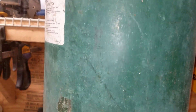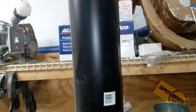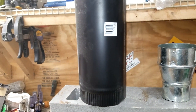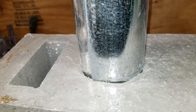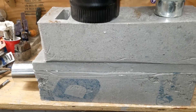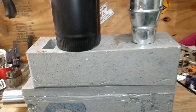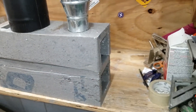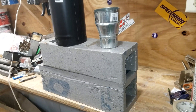This is my bell chamber. Inside my bell chamber is my stack itself, which the outside diameter will be six inches — I'm using stovepipe as a form and will probably just leave it in place. Inside I have three inch going into the burner itself. I will pour this in the same refractory concrete I've used for the entire lower body. I will wait to pour the actual stack until I get it put together, because I'd rather just pour it once right and be done with it.